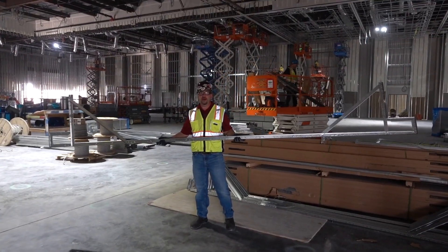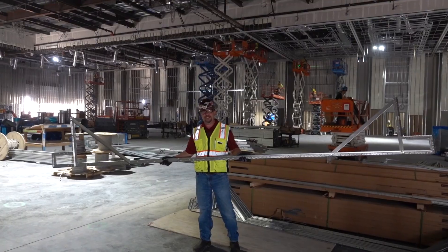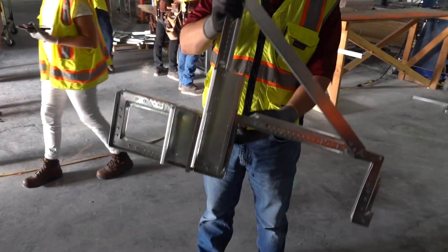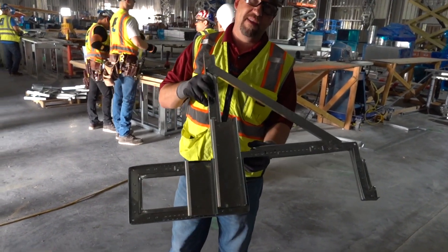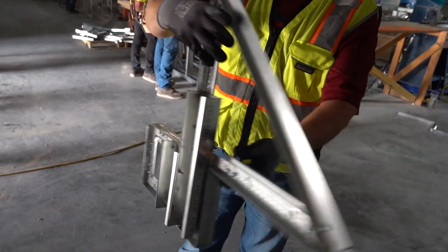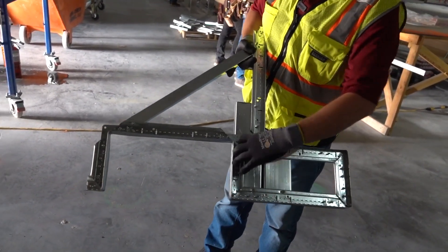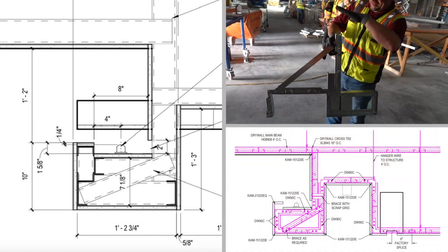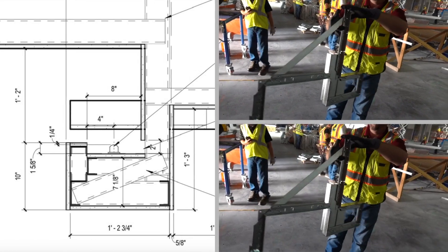Here you can see they're jigging these up. This is an exact light cove, and they're putting these on either four or six-foot centers — I like to call this a truss. Here's a great example of mixing traditional framing to beef up this truss. Because when you spin it around, you needed to tie it together. Originally this was a three and five stud drop, but we eliminated that stud drop going all the way up, and it goes to a sub-ceiling right here.